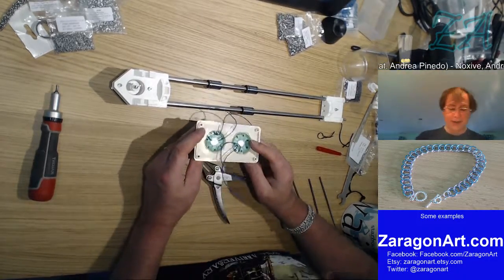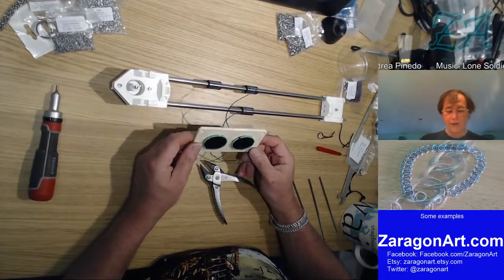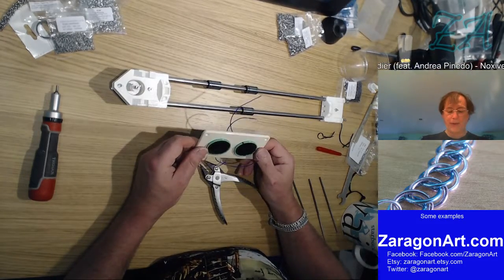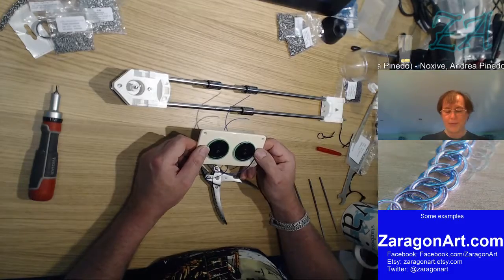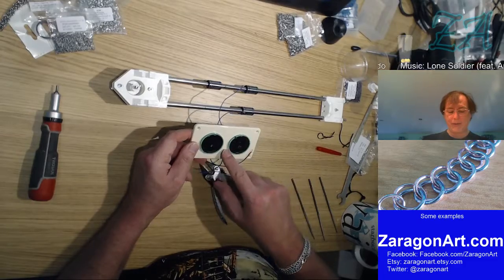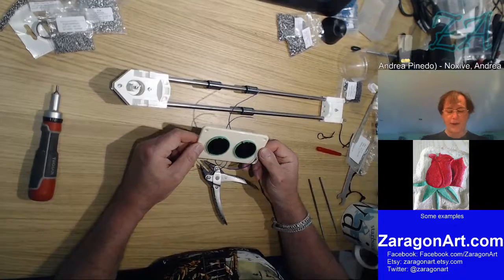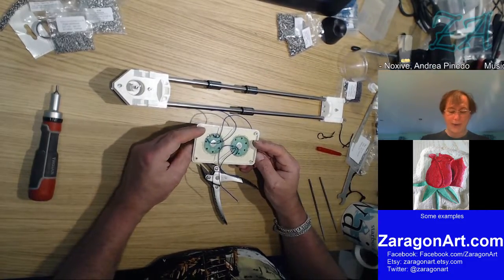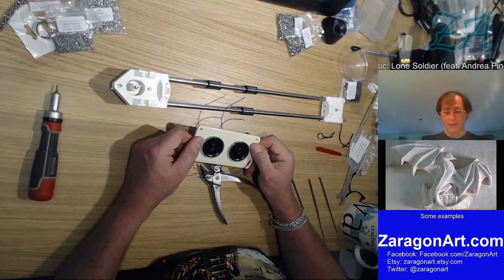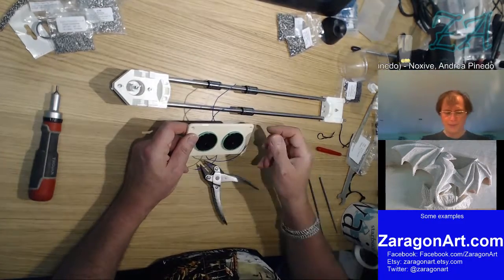But I do things like, I've got here this box lid, which has got a couple of speakers in the top. This is the sounder for a doorbell. Being able to print those out, perhaps with captive positions for these to sit. Because these are on the surface of this lid box, and it's really hard to do neat round holes and not leave gaps, whereas if you print it, the printer is a lot better at making round circles than I am at filing them.